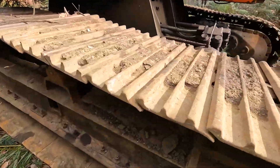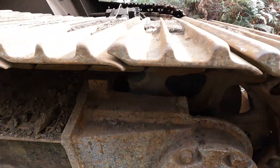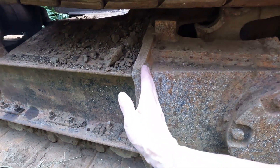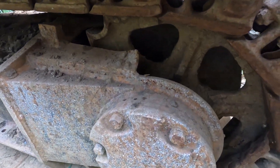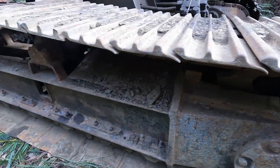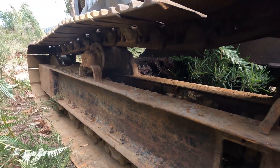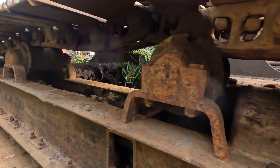This sprocket's actually not bad — must have been replaced at some stage. I don't know what's involved in replacing a sprocket like this, because on most machines the track frame finishes there and you can just pull the sprocket off easy, but this one's got a carrier bearing on it. These top rollers weren't turning, so they've just got flats on them now — even if you did get them to turn, they'd only do one turn and then stop on the flat again.